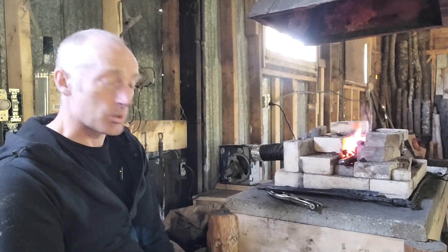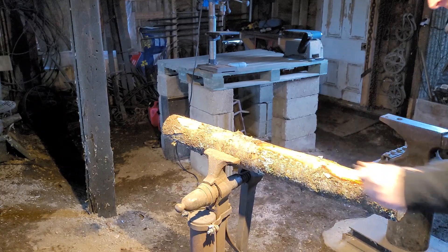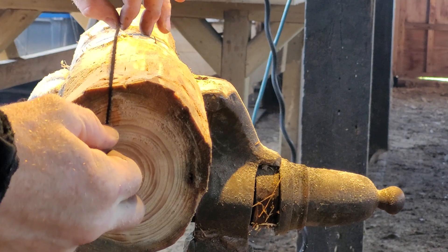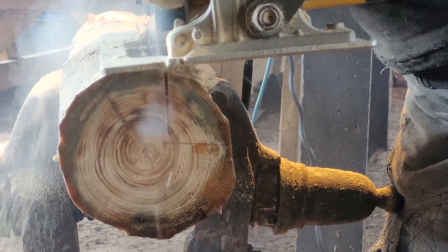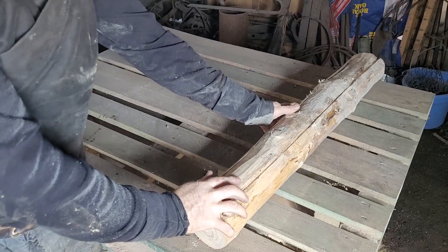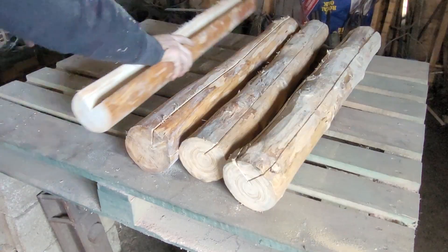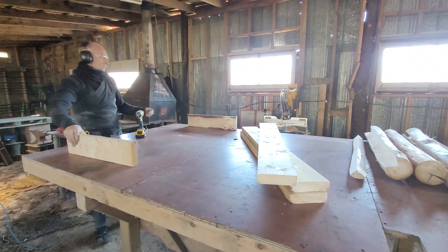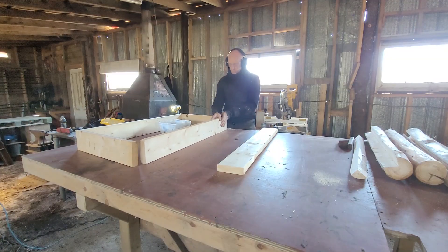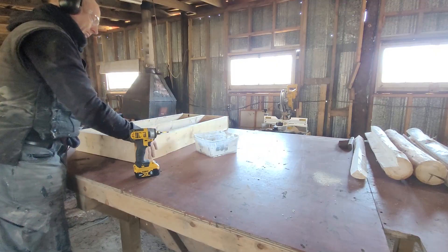Right now it's a tree that came down and some 2x6s left over from another project. This is a go-to technique where I take whatever length of lumber, cut a 45-degree wedge out of its side, and keep that wedge. That means I can take that leg and directly fasten it to any 90-degree angle. By keeping the little wedge, I can cut it down and it goes right underneath the main structure for extra support. With two 2x6s cut to whatever sizes needed, and a bunch of 3-inch screws, I get the base plate to mount the cinder blocks to.